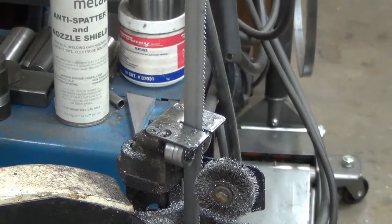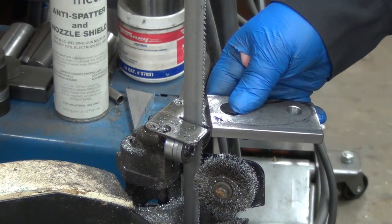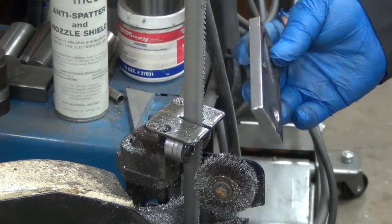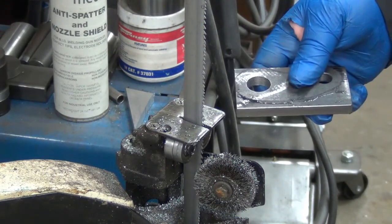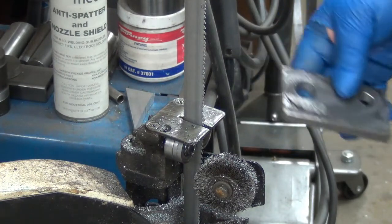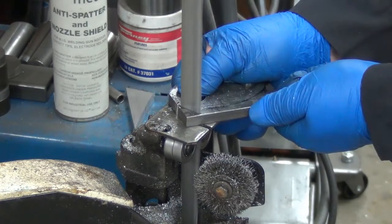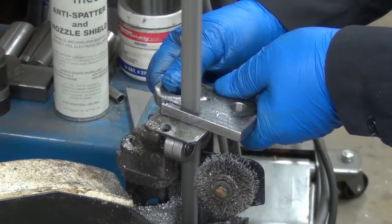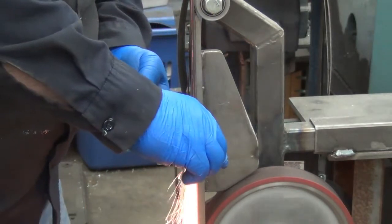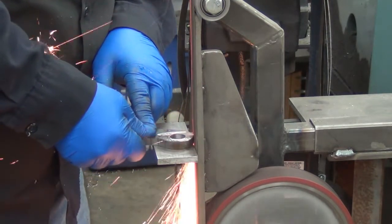As far as the holes go, the outside is really almost superfluous except for needing to do some clearancing on the inside. I'll cut the shape out and we'll go from there, then see if we can do the big bracket. We'll see how well the new blade does. With CNC plasma I could cut this out accurately enough. One of these days when I get a CNC mill, I'll just whittle these things out of steel or aluminum for testing. But it might not make sense to produce them that way because of speed and cost — though certainly for prototyping it would work.